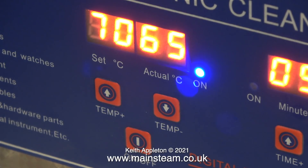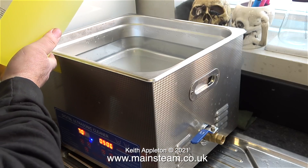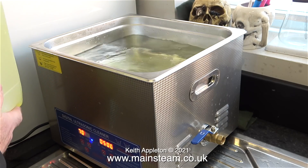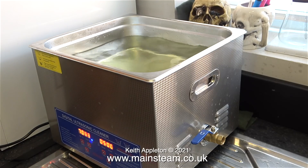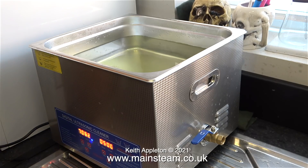It takes a while for the temperature to start climbing. I bought some special solution to put in the water. Before I bought this proper solution I did try some other methods — washing up liquid worked very well, and a dishwasher tablet worked even better. I ground up a dishwasher tablet in my old mortar and pestle and the ultrasonic cleaner did a really good job. I'm guessing how much of this yellow liquid to pour in — I've possibly put too much, but I'll add a bit more. You can be very economical with it by putting the liquid in a plastic bag with the part inside so you can reuse it, but for this job I just used it as designed.